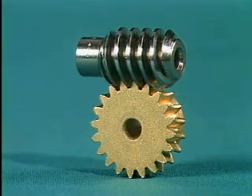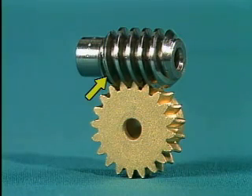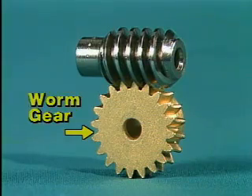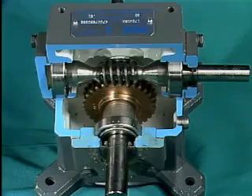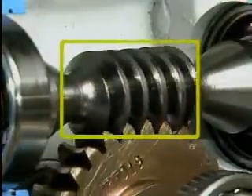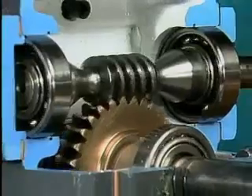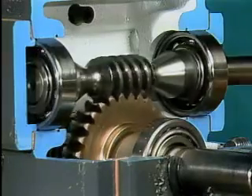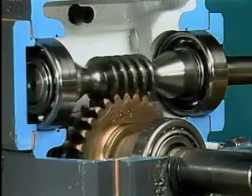The gears we've looked at are some of the most common types, but there are other types as well. A worm gear set is characterized by one of its members having a screw thread — this part is referred to as the worm. The other member is called the worm gear, or just the gear. Worms are generally mounted on shafts set at a 90-degree angle. Power is usually applied to the worm, which in turn drives the gear. The worm is considered to be the pinion of the gear set. Because a worm has very few threads or teeth, a worm gear set has a very high gear-teeth to pinion-teeth ratio. Worm gear sets are generally used in situations where a large speed reduction with a subsequent large increase in torque is needed.